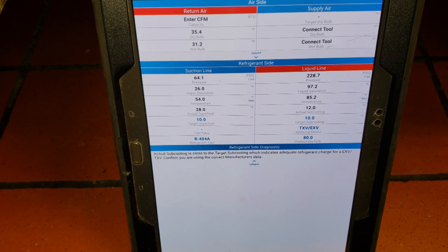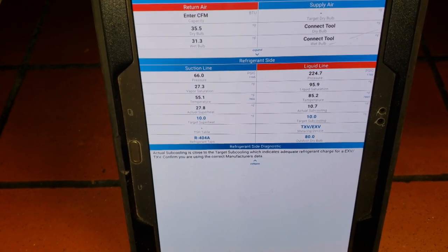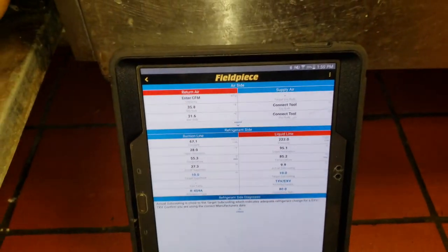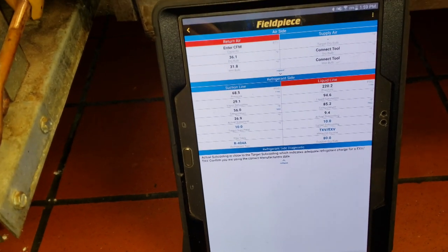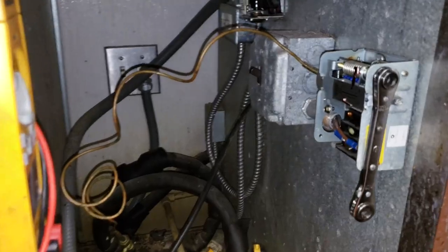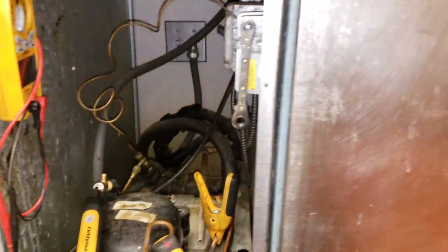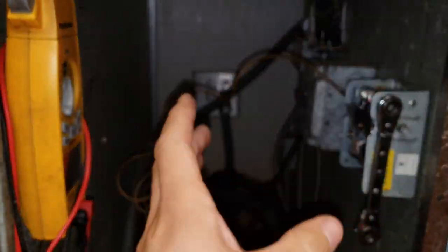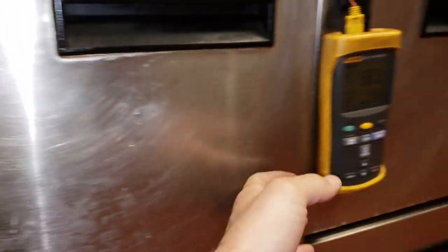We just cycled off at 35 to 34 degrees, pressure at 66. We're watching it turn back on and monitoring temperatures. With some tweaking I got it set where I wanted it - just some fine-tuning adjustments. I used those initial ballpark numbers of around 85 and 40-something and then tweaked from there to get it dialed in.